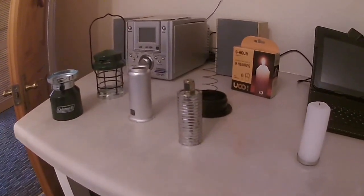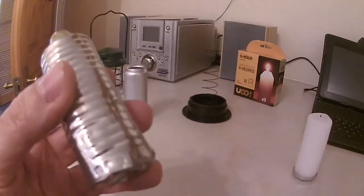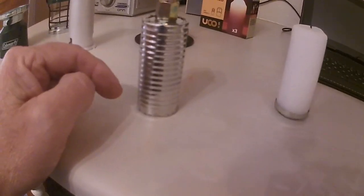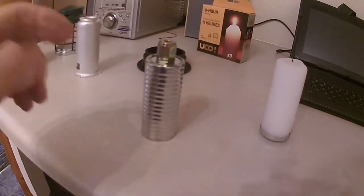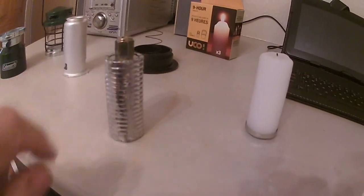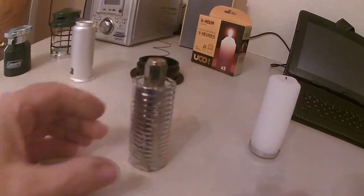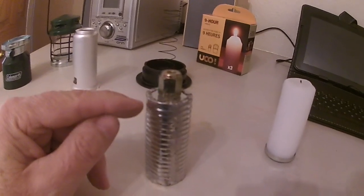Okay, this is where I've got to with regard to this unit to run from lamp oil. Just to recap, I've used a baked bean tin. I've taken the ends of the baked bean tin off. I've then cut it down, seam soldered it. I've cut a piece of the aluminium can, made a bottom and soldered that in. I've then used some brake pipe fittings through 2 or 3 washers.